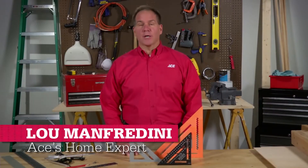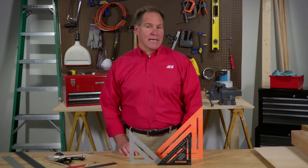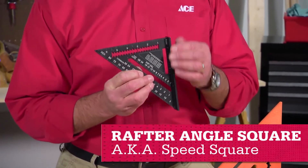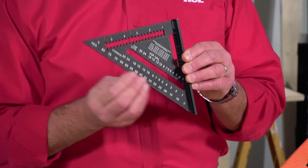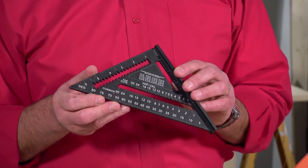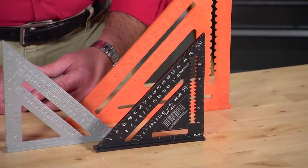These squares have built-in shortcuts for specific projects and are helpful to have for some general tasks too. Here's how to use them. The speed square has a basic rule and a lip that fits over the edge of a board. You'll usually see rafter angle degrees and angle indicators from 1 to 90 degrees marked on the diagonal edge. This little tool packs in quite a few useful features.